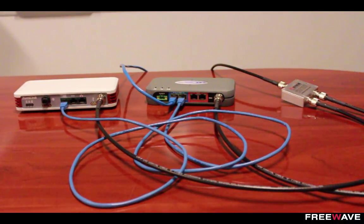ZoomLink has two unique algorithms as part of its ZoomBoost technology that make coexistence possible. These algorithms are called adaptive spectrum learning and listen before talk. They increase throughput and resiliency in coexisting environments by learning which RF signals are part of the ZoomLink network and which are not. These algorithms are part of the ZoomLink RF protocol, which means they do not have to be enabled or configured. ZoomLink also provides additional ZoomBoost performance-enhancing algorithms utilizing RF enhancers like packet compression, packet aggregation, and forward error correction, along with IP filtering, which can help maximize throughput and increase communication success in more challenging RF environments.